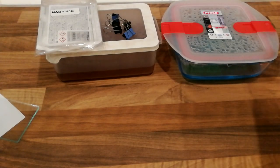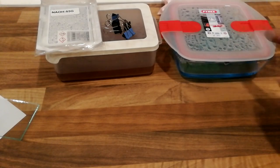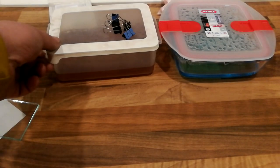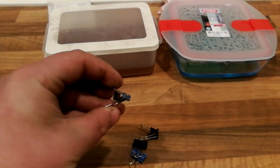I of course don't do that much at a time when doing boards like this. So I have a couple of deciliters already mixed here. Same goes with the developing agent - I have like 2-3 deciliters. I have a couple of these clamps - these come with 3D printers at least. I use these to clamp the glass.